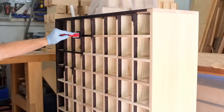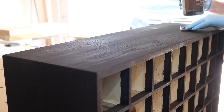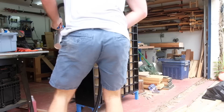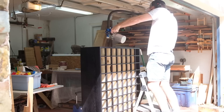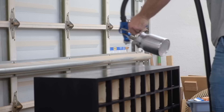Let's talk about the black finish on this oak. Earlier I dyed the inside faces with a jet black dye. My plan was the same for the outside with the addition of a stain to get deeper into the pores. This worked well and left me with a super dark jet black look. The issue arose when I went to spray a water-based lacquer over the oil-based stain — I only let it dry for 24 hours, which apparently wasn't enough, so I sanded everything back and reapplied to the whole cabinet and let it sit for three days. I also sprayed a coat of shellac hoping it would give me a barrier between the oil and water. This seemed to be working well but I noticed some spots had a slight texture resembling the finish lifting, so I had no choice but to sand it all back once again.